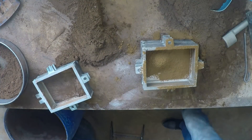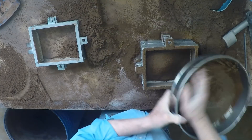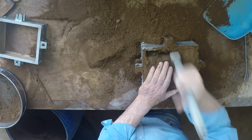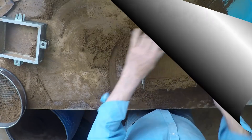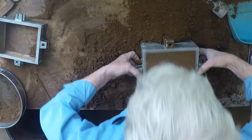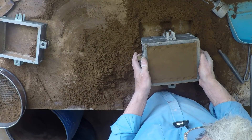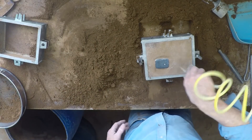This time, thanks to the odd side, I will not have to cut the parting line again. These sand odd sides don't last all that long — they tend to compress each time you ram a mold against them, they tend to get rammed down a bit more. But you can get five to ten castings out of them — ten with luck. Quick tap again to make certain the odd sides are loose, carefully lift it off, and there we have our mold, parting line and all.